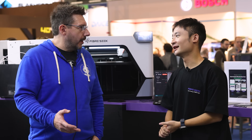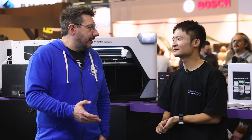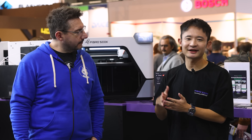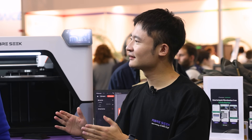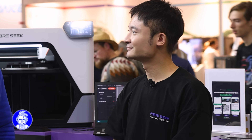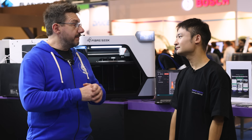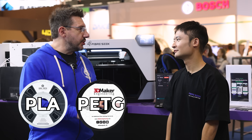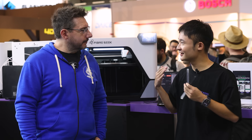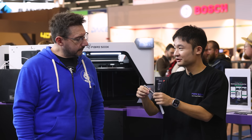I always wanted to develop a system that every engineer or maker could afford. Who doesn't want strong parts? Everybody wants strong parts. I'm a car person — I always want to print parts to customize it. And you're not going to do it with PLA or even PA-CF, it doesn't work. You get close, but you're missing a very specific element: that fiber load. When people talk about strong parts, they automatically assume metal. But between metal and plastic, there is actually composite — composite carbon fiber. And if we can print them on the desk, you don't have to mess with metal powder stuff, and it's as strong as metal. Let's approach composite parts using chopped fibers — that's very synonymous within the consumer 3D printing industry: PLA, PETG, ASA, ABS. You've got chopped fiber parts, and it gives a really cool surface finish, but it doesn't give you the strength. I always use this joke: it's like bones to your body. But if you chop your bones, you're not going to stand here. You want bones to be continuous — like continuous fiber. It's the same concept.